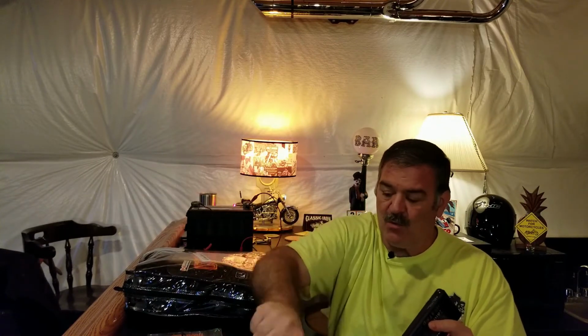And they give you the wall wart. They're not going to make you sit there for a day and a half connected to a USB connector. They give you a wall wart. It's not heavy, which means it doesn't have a transformer, which means it's a quality switching power supply. That's just my electronics background. It's one of the things I look for when I pick up something that plugs in the wall. If it's more than a couple ounces, it probably has a transformer in it. It's junk. So they invested in this thing.